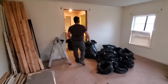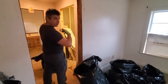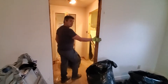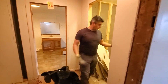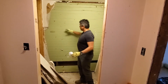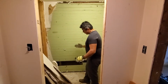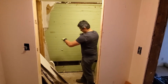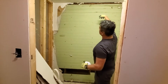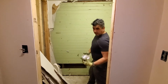Let me show you what we found in these walls. Back in the day they didn't have drywall — they used beaded board in different thicknesses, and you'll find it throughout the entire house. Behind it there was nothing, just a void. Now that we're dismantling the closets, beaded board was installed with a tongue-and-groove tool, running from the bottom all the way to the top. We may sacrifice a little at the top, but we'll try to dismantle and reuse it for bookshelves or to feature on walls elsewhere.